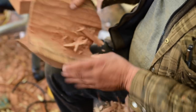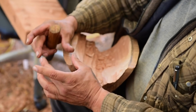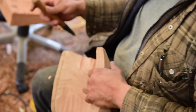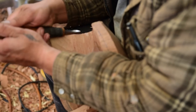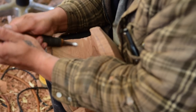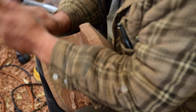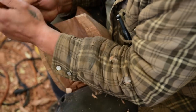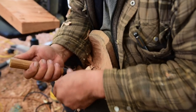A big safety concern is just letting the chisel get away from you — not gripping the knife tight enough. One guy had a slice about that big out of his leg from one of Tom's big curves and just managed to hold it back up. If you're not pulling in the right direction you don't have control over your chisel, and with these super thin blades they will just bury themselves into your flesh pretty quick. You've got to work up to this kind of speed and pressure — if you don't respect the tool, you will pay.